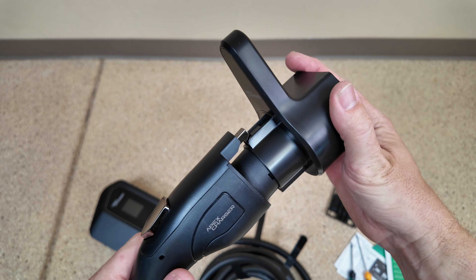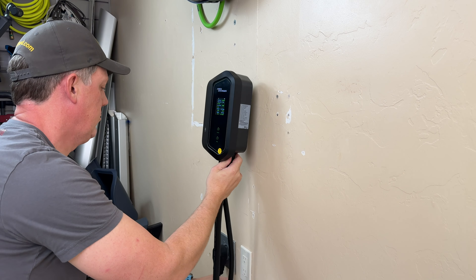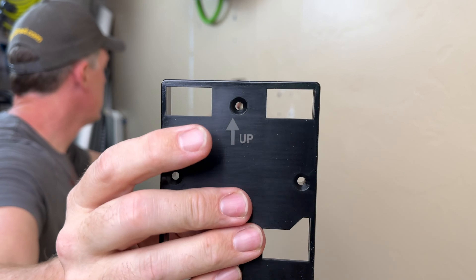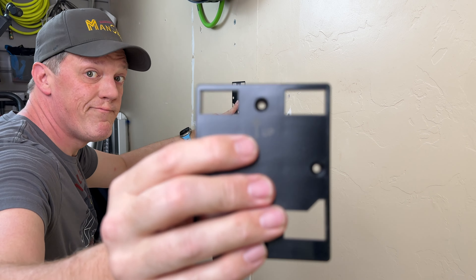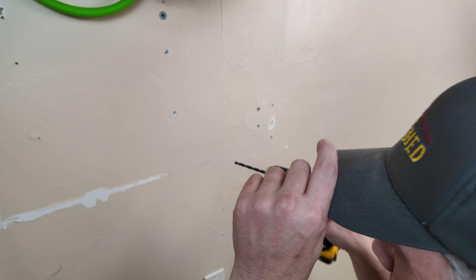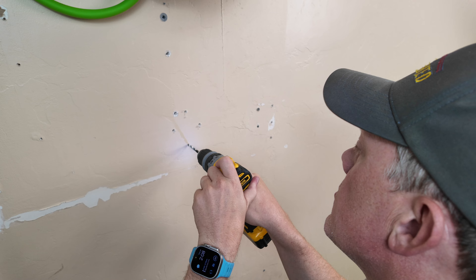Here's the main unit itself — it's small and compact. I love that, and there's easy access to their 24/7 support. It is a max 48-amp plug-in or hardwired charger. If you're going to be plugging it in, just make sure you place it where the plug will reach, and make sure you have the mounting template up because the bracket has an up direction. I was able to use the screwdriver to mark the holes and then drill pilot holes before anchoring it to the wall.